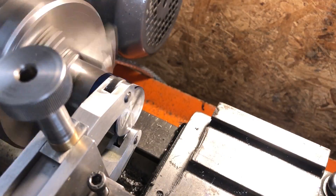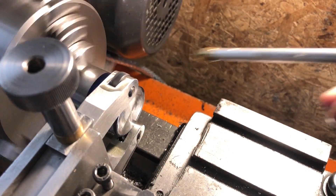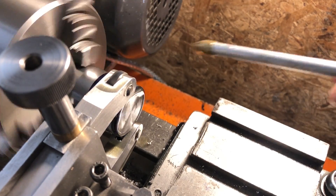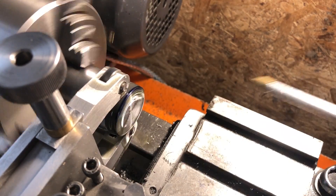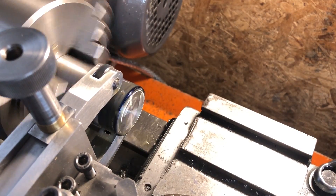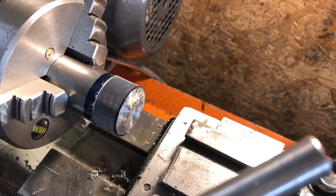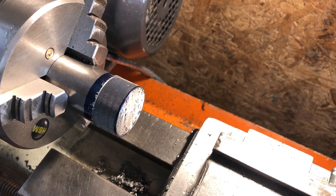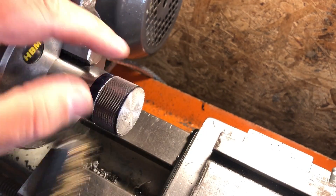When it comes to surface finish, I find that there is always a witness mark both where the tool starts and where it finishes. So after setting the tool depth some distance from where I want my final surface, I'm feeding under power until I am past it. I will then be able to turn away any unsightly marks and be left with as clean a knurl as I can get. In terms of feed, I always use the slowest power feed available, and the results usually come out just fine.